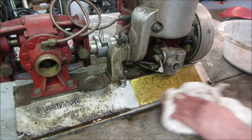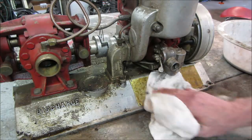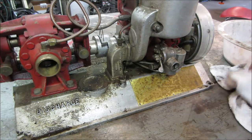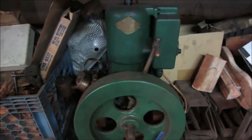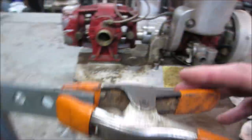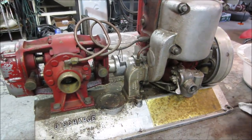This came from the same source as my old time viewers. We had a marine engine, would have been the actual engine for the boat that powered it, either a sailboat or some kind of little skiff or something. They had a tag on it that said lovingly restored for a museum. I'll show you, it's right behind us. It is that one right there. If anyone remembers that one, I think that one's like 1929, I think we found the year for it. Anyway, it looks pretty on the outside. When we got into it, the cylinder was really corroded. It was missing a ring and a bunch of other stuff. It was very hard to make compression. We got it to run, but it never ran well. Hopefully we have a little bit better luck with this one.